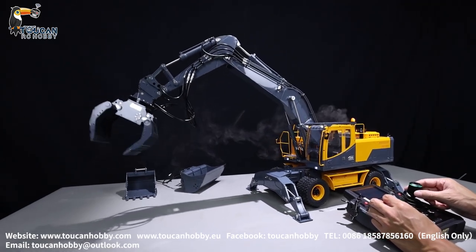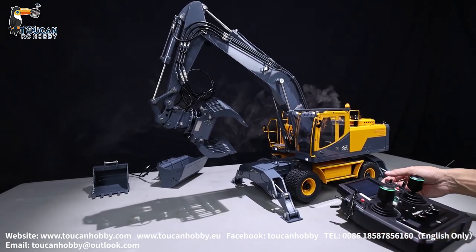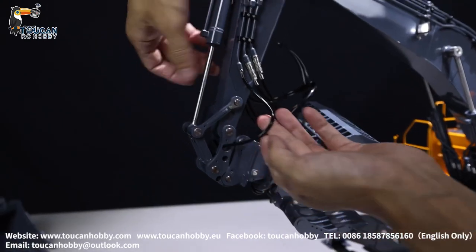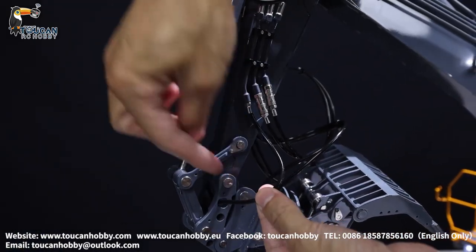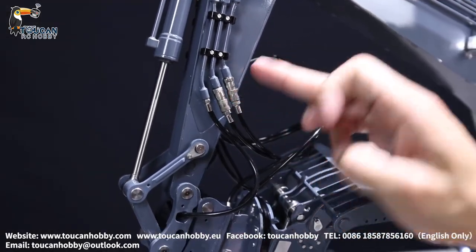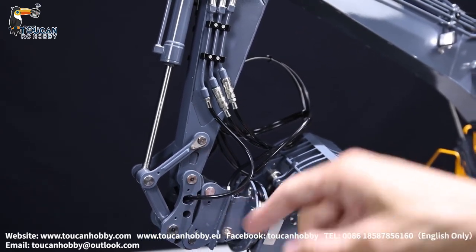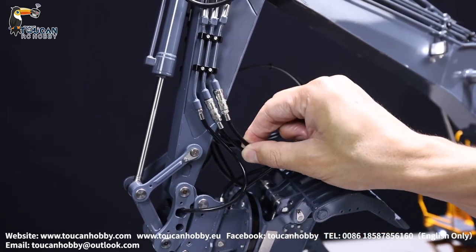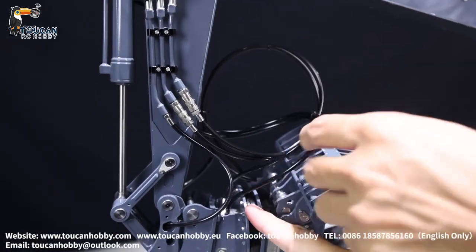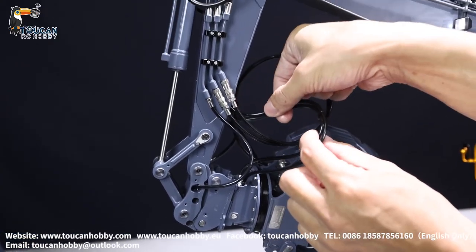I will change to a tiltable bucket. With the grab on top, these two holes on top — that's for quick connection. This side, that's one pair. Do not connect left to right as one pair — that's not correct, you will break the turning block inside. Left side for opening and closing the bucket. Right side two holes — that's for spinning, turning the bucket; these two holes connect to one side, right side.